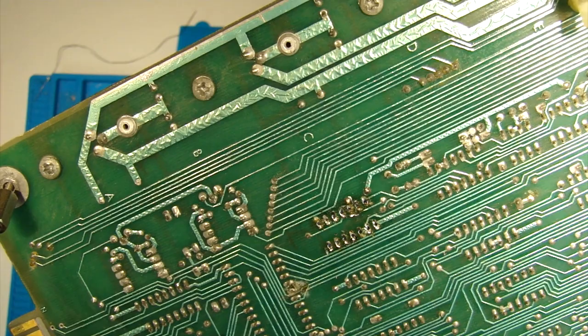I just want the iron on there long enough so the solder can flow through the hole, but not too long as to damage anything. If I do say so myself I've done a pretty good job on that — you'd hardly even notice it had been changed. The satisfaction of plugging in a new IC. Sometimes if the legs don't quite want to go in, just run the chip along the table side to bend them all in slightly at the same time. There we are, it's in. Question is — will it work? Will it make any difference at all? Let's go and find out.